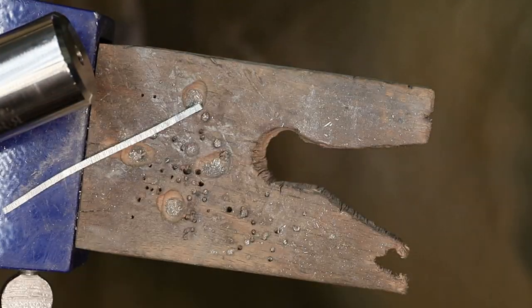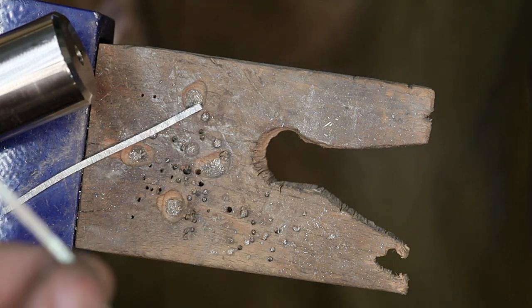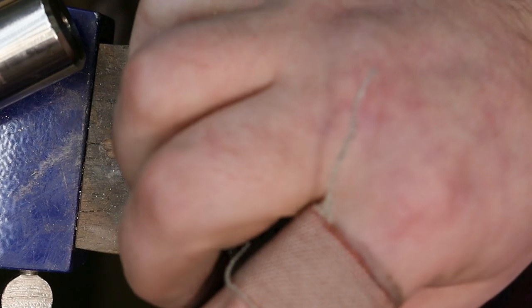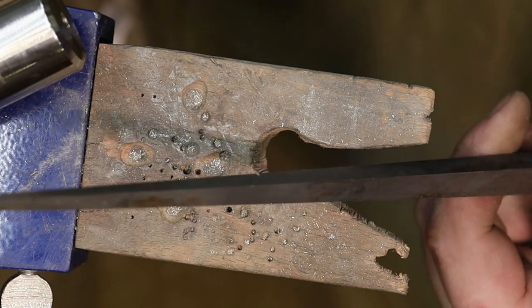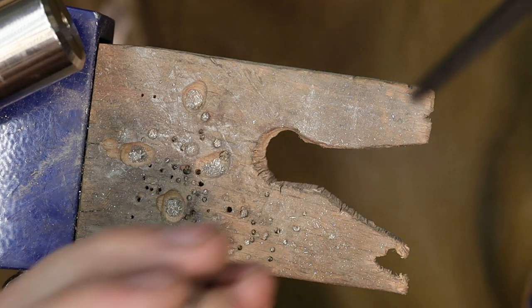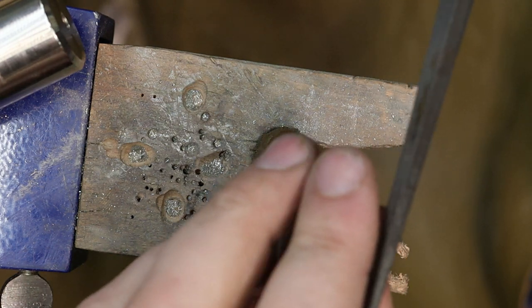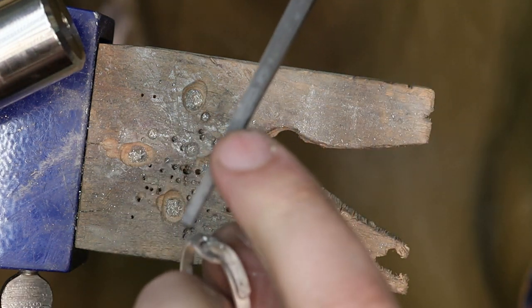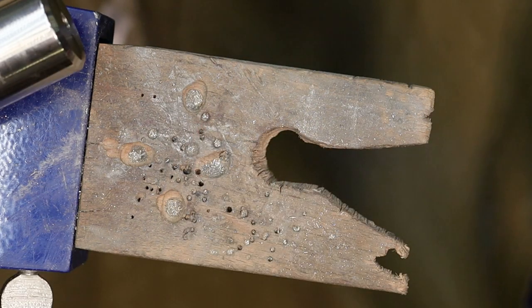The next thing we're gonna wanna do is make our sideband. Take our small square, like one of these bezel mandrels. I'm going to take a look at my ring. I'll find out about the width I want. Right about there. So I'll be forming on the tip portion here. And I'm going to select my metal. I'm going to start off forming it smaller than I need to.